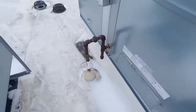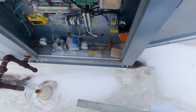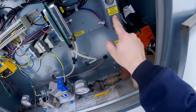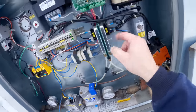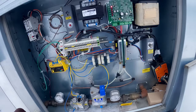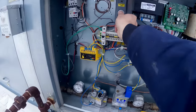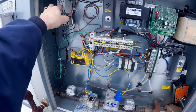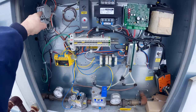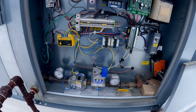I don't know if I hear anything going on here. So — burner off, intake air thermostat can't run unless it's 50 degrees out. Operation controls: red limit does not feel tripped. Air flow switch just made.